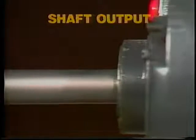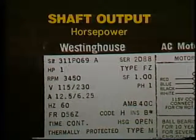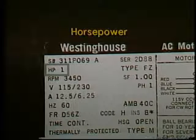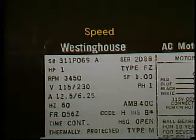The first of the output specifications is horsepower. A replacement motor must produce the right horsepower. In an emergency, a motor with higher horsepower might be substituted, but it would operate at part load and therefore less efficiently. The rated speed of a replacement motor must be the same as that of the old motor in all cases.